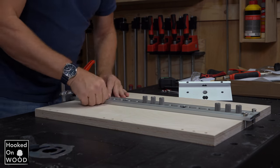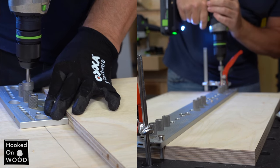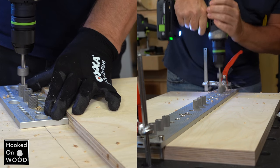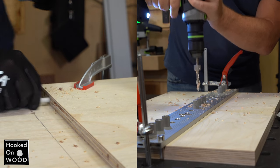After this, it is just a matter of clamping and drilling. This works so straightforwardly that you can make a row of perfectly aligned holes within just 30 seconds. And if you compare this to just the use of the doweling jig alone, there is a big time saving here.